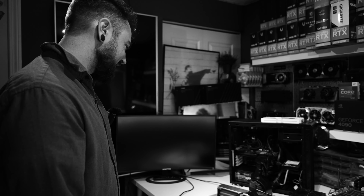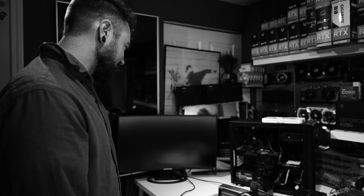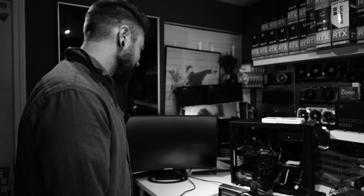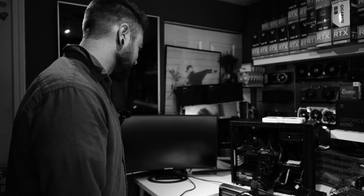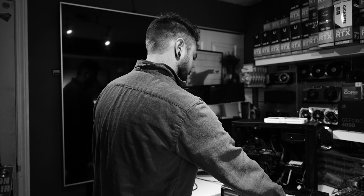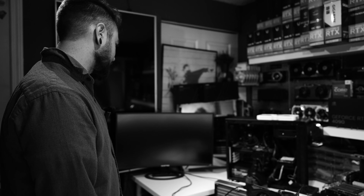This is not going to post. Unfortunately, there was a tiny bridge, and where I had broken one of the pins off, one pin was so bent down that when I moved it back it became so fragile that the solder got between the pins and connected them, causing a short. So of course it's not going to post. Unfortunately I had to take one of those pins out and during that process an entire pad got ripped off, which means the whole thing is not good in that area whatsoever.